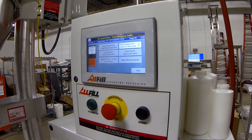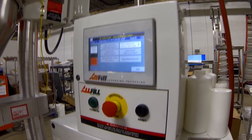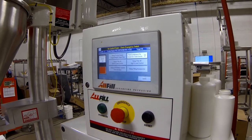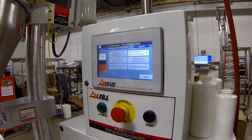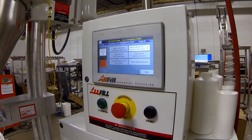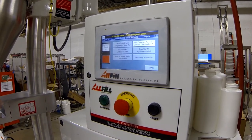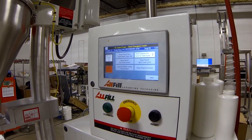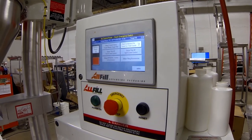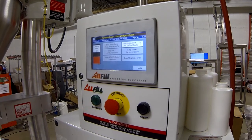You can dry run — that'll do everything except dispense powder. It's kind of like what we were doing when testing the indexing. In the test menu you do things one at a time; dry run actually checks all your timing as well. If it takes one second to move bottles from here to here, you can verify that one second is enough or shorten that time. In the test feature you're not looking at timers; in dry run you are looking at all the parameters you put in, and it will try to simulate your auger time.